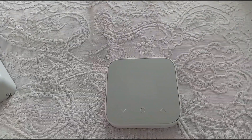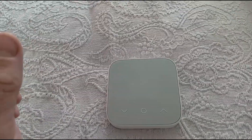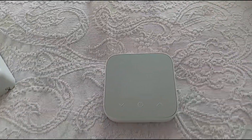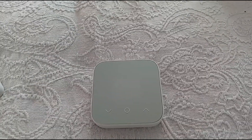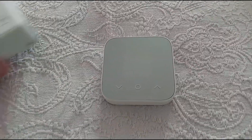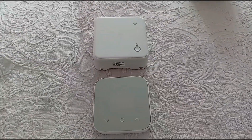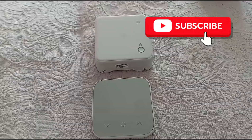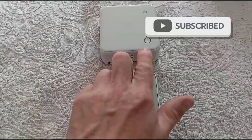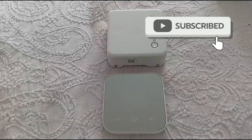You can't heat your hot water to say 40 degrees and use this thermostat to make it stop unless you've got some other thermostat — like I have — which controls the actual heat setting before it trips the servo on the valve. But yeah, you can either get it single zone single channel, or the double channel where you get two channels to control.